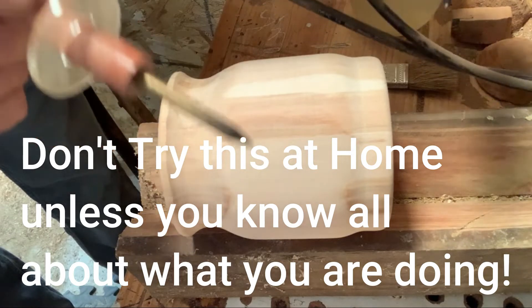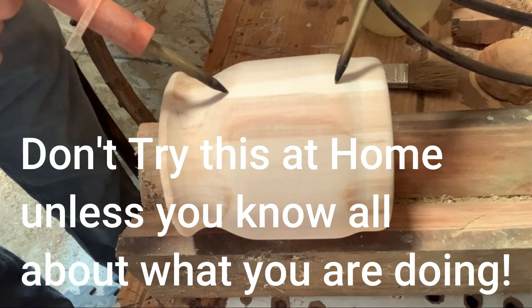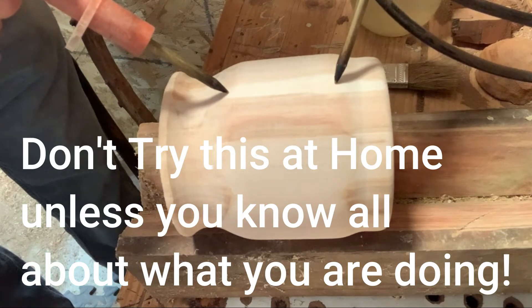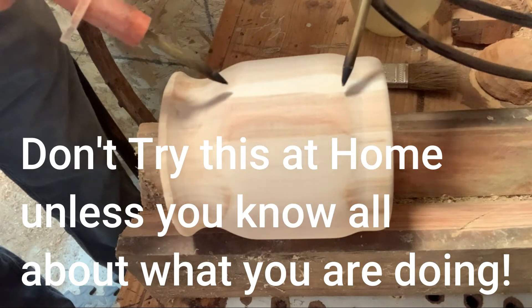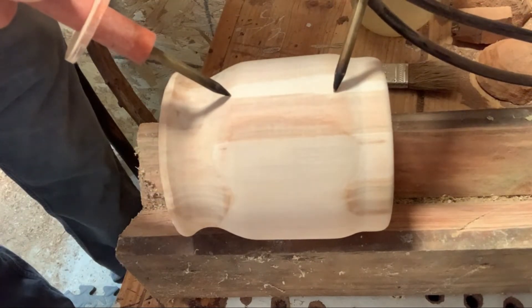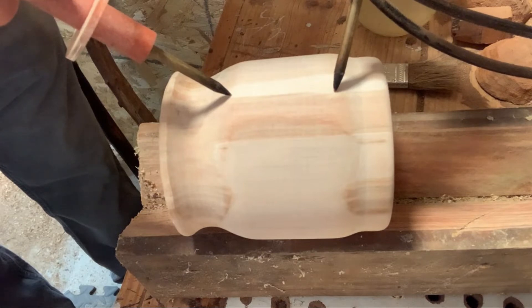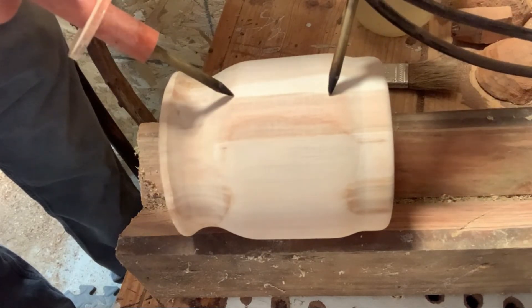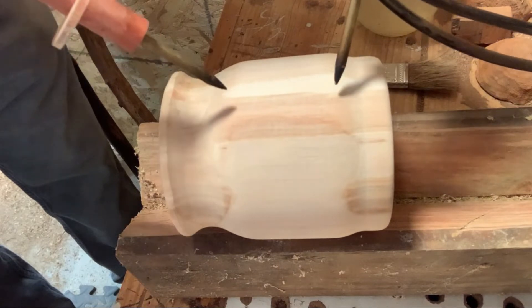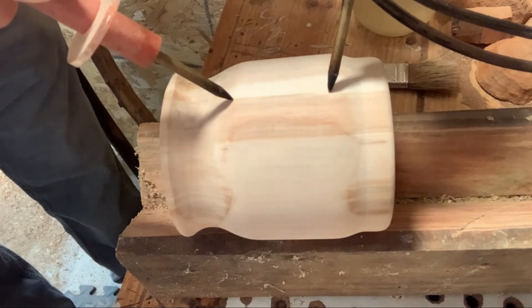This is 15,000 volts — you'll see that creates this design. You'll see it in a minute when we get it all set up. What I'm about to brush on this is a water and baking soda solution. I use one spoonful per quart of my solution. It has to be not too wet, not too dry. If it doesn't work really good, maybe it's too dry or maybe it's too wet. So we'll go from there.